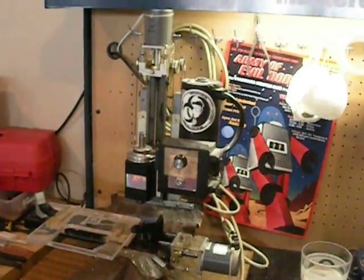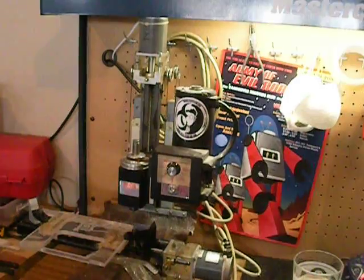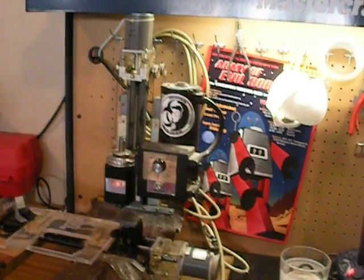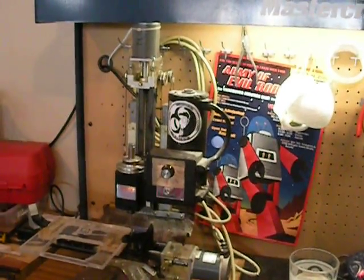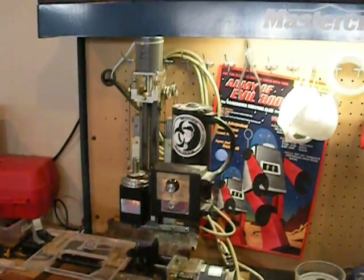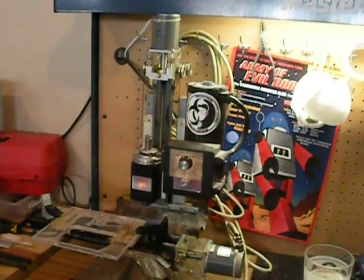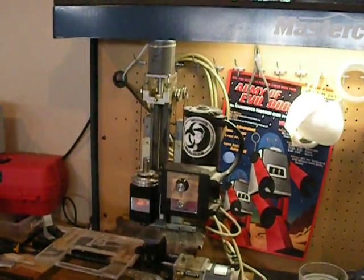The other problem was I was using a laptop, which has System Management Mode. System Management Mode is the part of the software that kicks in to run fans or turn the processor speed up and down to deal with thermal effects, among other things. It's not unusual to have a two or three millisecond pause in your CNC run. When you're sending 10,000 steps a second on your CNC steppers, that translates into a crash.